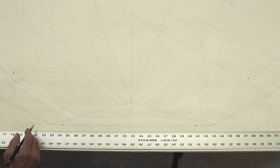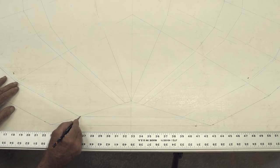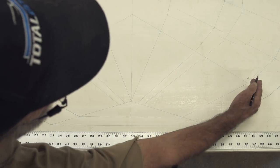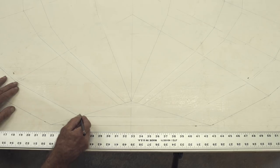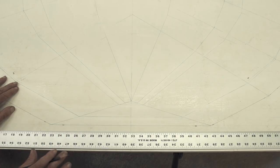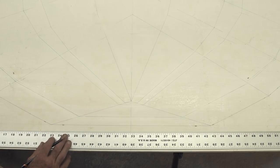We're out to build section number two, which lines up with this line right here. This is the bottom line of it — the very inside of the boat — going up the other side. There's a deduction of an inch and an eighth from this one, so I'm only going to build the mold down to this line right here. I'll explain why a little bit later, but it's to bind the bottom of the boat together with a false bottom.